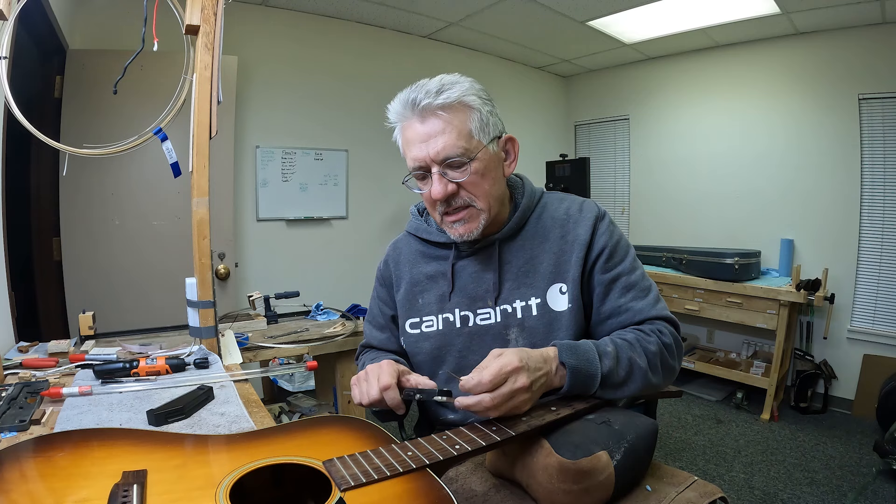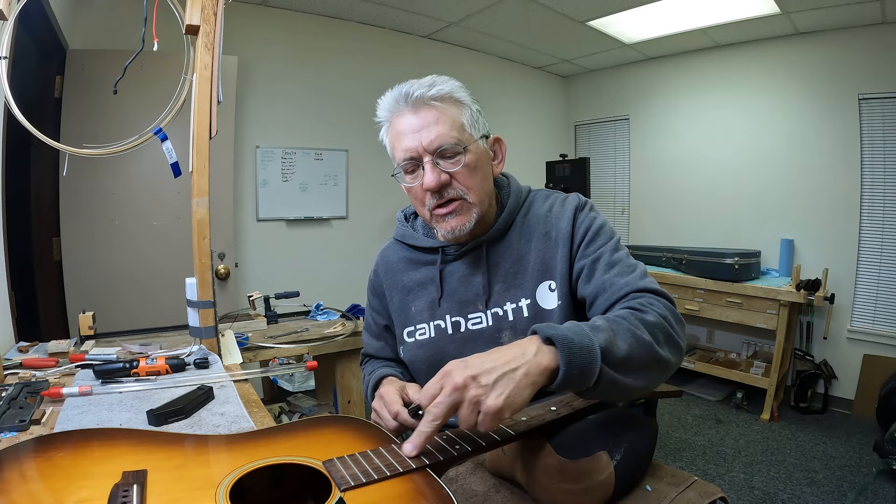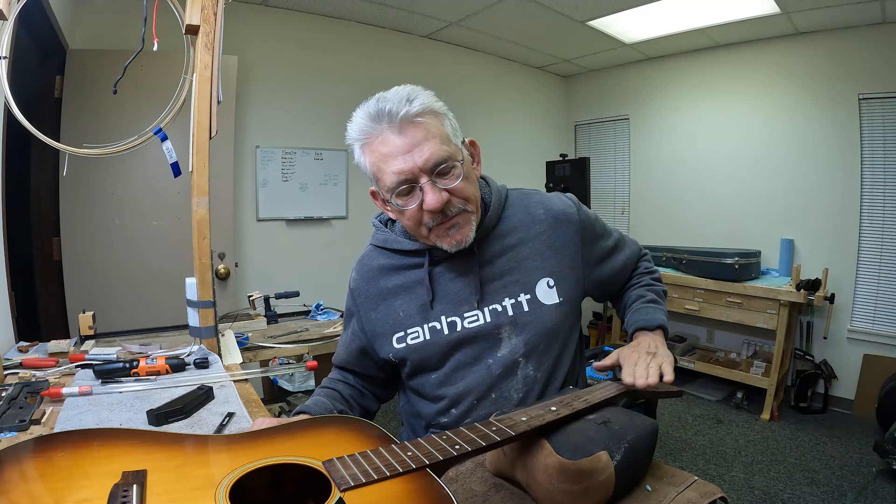While this is sitting in my hand, let's go ahead and measure what this actual fret is. This is 40 thousandths of an inch — so these frets were 40 thousandths of an inch, full height. There's my point: these upper frets are still full height, no divots, perfectly good frets. But if you take your file and level all the frets, it won't be long before these upper frets wear down, become hard to fret, and then you're going to have to replace them.